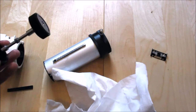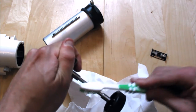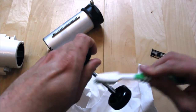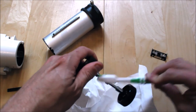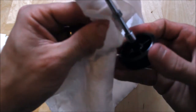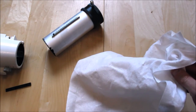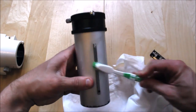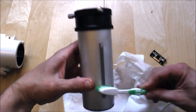Because it sticks in the gears, using the toothbrush will help — just brush the toothbrush like so and you can remove some of the old grease between the gears. Brush downwards evenly along the spur gear itself. Spray a little bit more WD-40 and just keep brushing along that gear. Once all the grease is removed, as you can see, we're starting to see it's getting very clean now. Let that dry off overnight or wipe it with a clean cloth.